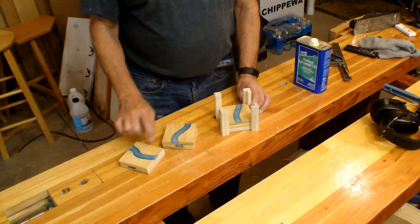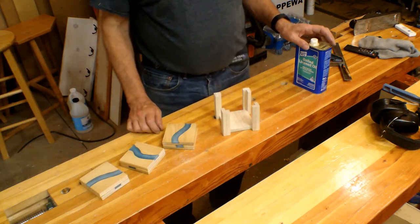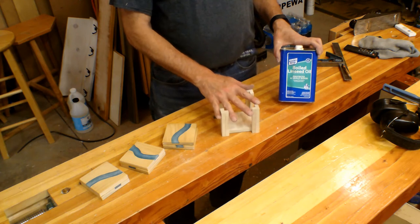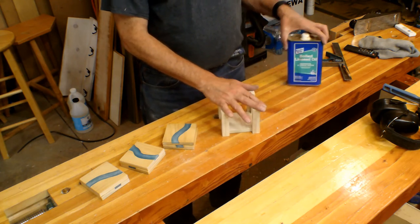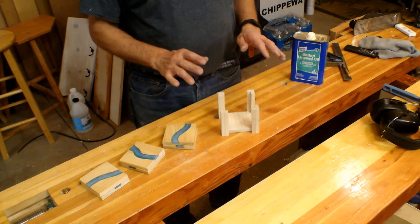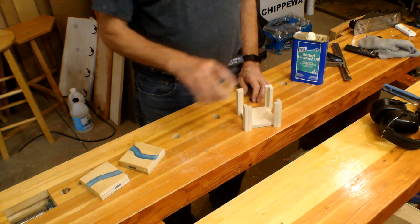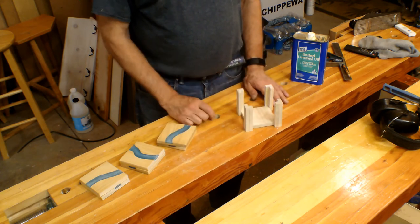one more coat of finish on tops of these. I wanted to have three coats of polyurethane to protect them from water. And then I'm gonna use this boiled linseed oil on this piece because it's not being exposed to water, and I like the way the boiled linseed oil looks. It is a much thinner finish and not quite as durable, to be honest. But again, you're not really holding on to this very much. It sits in the corner. These things get dropped in, pulled out. Once I put the linseed oil on and then I wax it, it'll be great.